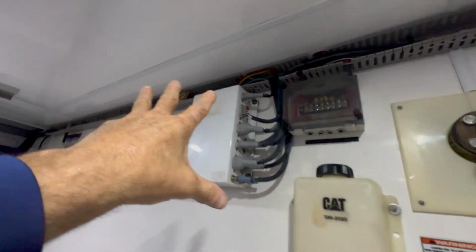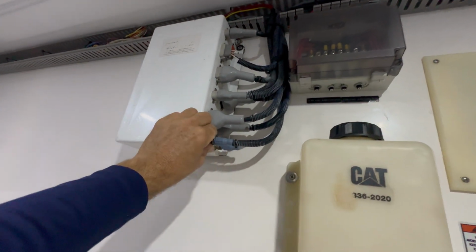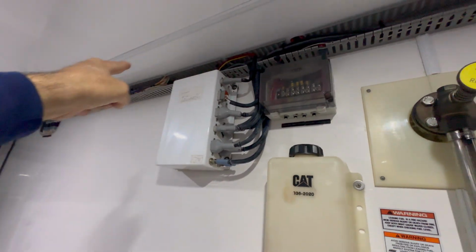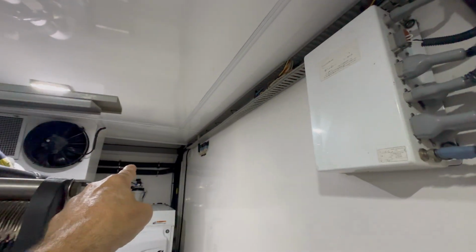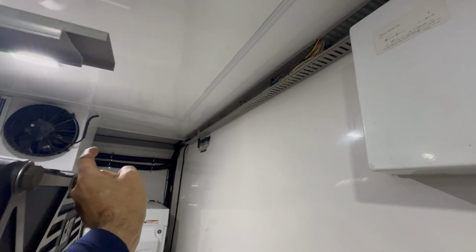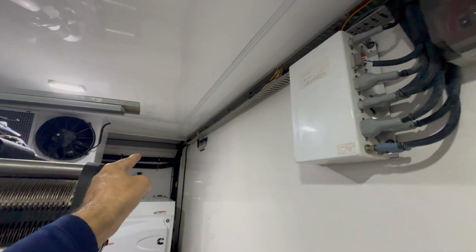Okay, so I've already explained this portion to you. So now I've removed the chases on here to find out where my digital cables are running. So we got the digital cables running to the port side on this boat. We tried looking over here, it doesn't go this way. So the cables end up going that way. So now I'm gonna go to that corner, and I know it's gonna go through the bulkhead. So now I need to get on the other side of this wall to find out how to run my backup harness and my backup enable harness.